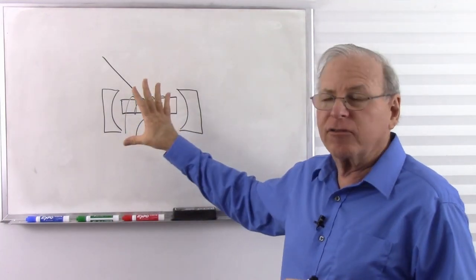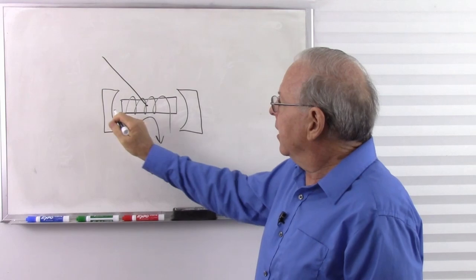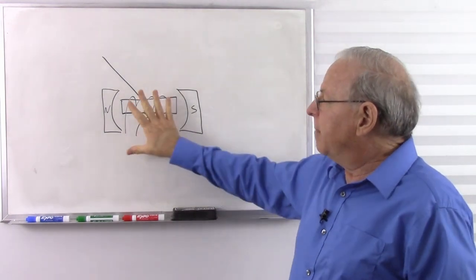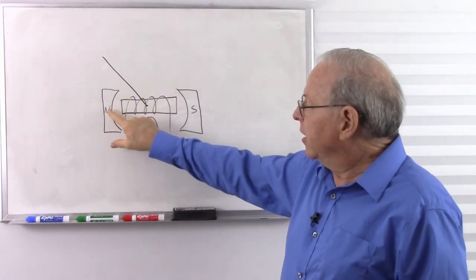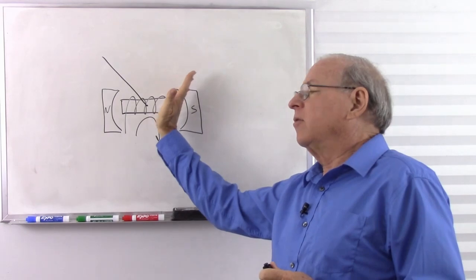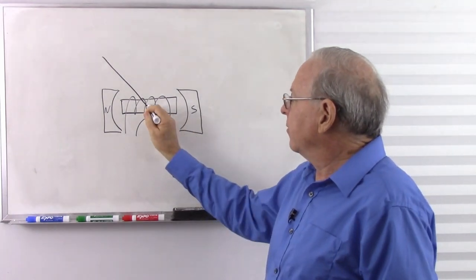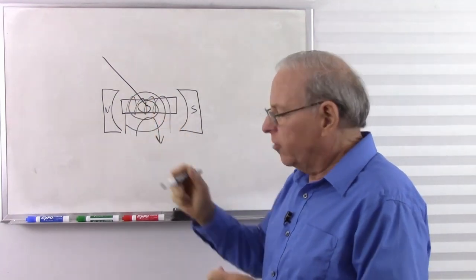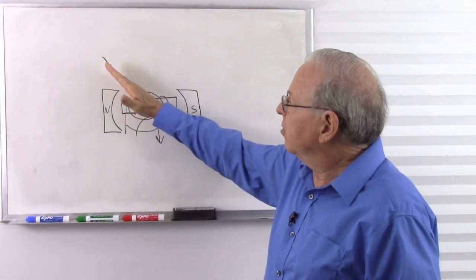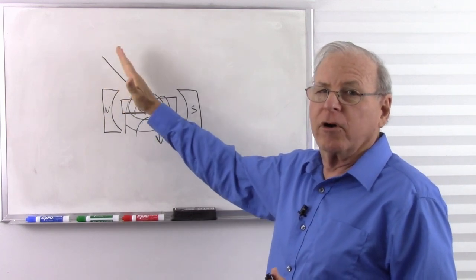The magnetic field of the electromagnet works against the magnetic field of the permanent magnets and causes the electromagnet to rotate. Of course, without anything stopping it, it would just rotate over and hit the end. So we mount a precision coil spring on it, so that we know how much current we put into the coil versus how much it turns against the spring. The more current we put in, the more it pushes — more current means more deflection of the needle.